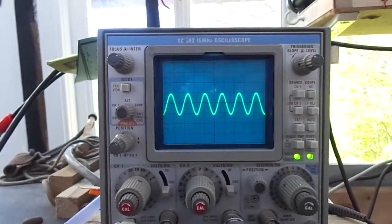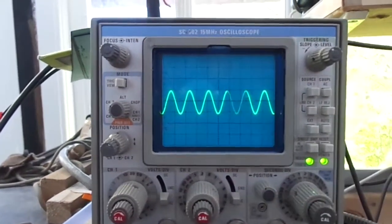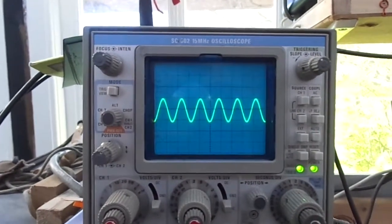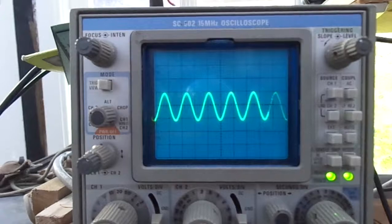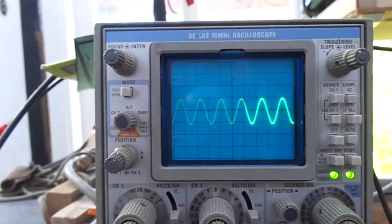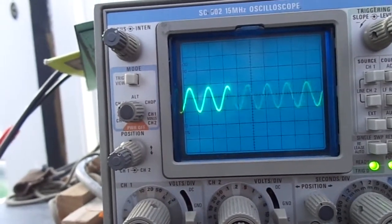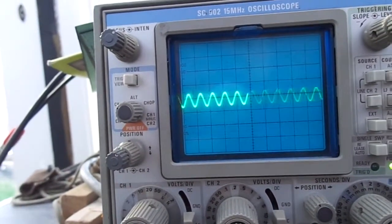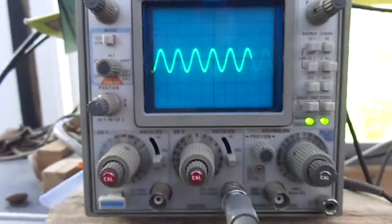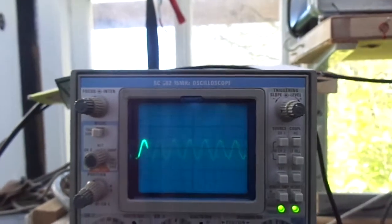Okay, I've got it all connected up. I'm testing the highest, what is it, highest pass? I designed it to have a cut off at 300 Hz at the top. So that's the pot set to its highest frequency setting, if you get me. We're on about 300 Hz. And as you see, it's starting to attenuate. So that's its high pass, highest pass band thingy.